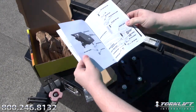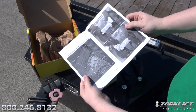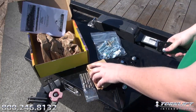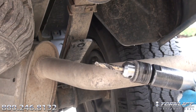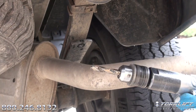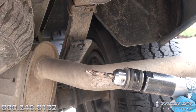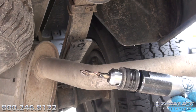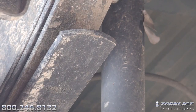As you can see from the installation instructions, the only thing you're going to need besides your basic hand tools is a low-speed drill and some cutting oil or motor oil. We put a simple butterfly shutoff valve in the air line prior to the drill so we can regulate the air pressure going to the drill to slow the drill speed down. That's a simple way of reducing the RPM of your drill motor, and you really need to be in that 200-300 RPM speed to maintain the life of the drill bits.